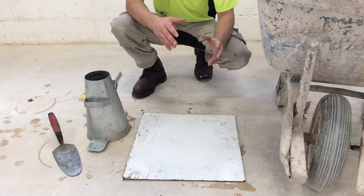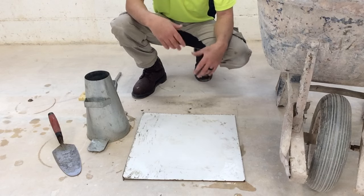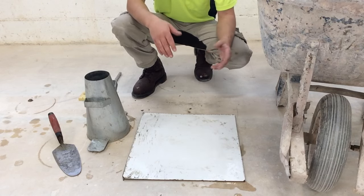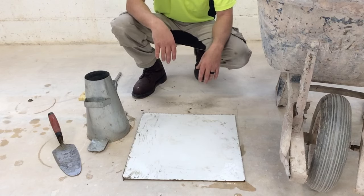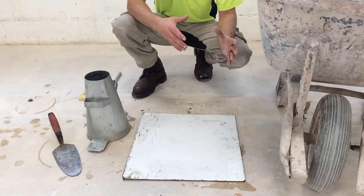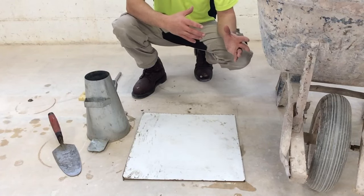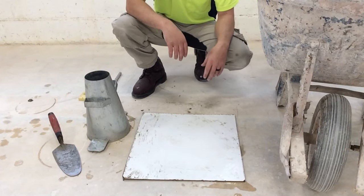Not the very beginning of the truck. I'm gonna wait a couple minutes after the concrete sort of gets flowing. Any dry, crispy stuff that's on the concrete driver's chute is gonna be eliminated, and we're gonna get a good sample towards the beginning of the truck, but not right away. So we're gonna pretend that that's what this is a sample of, towards the beginning of the truck.